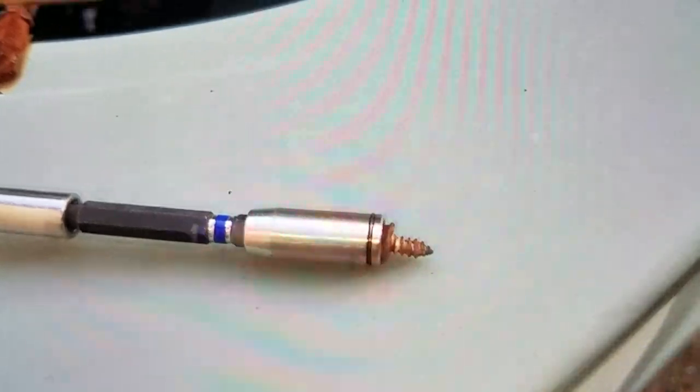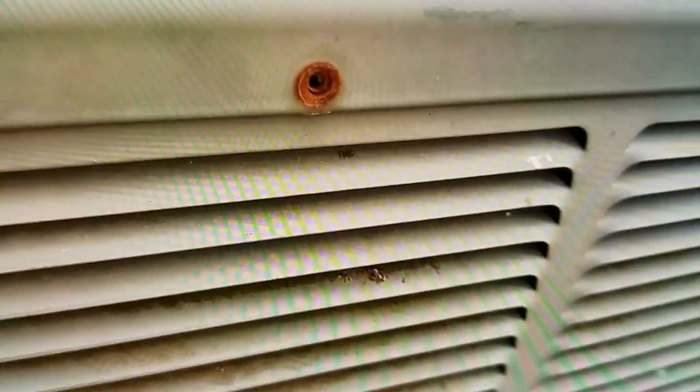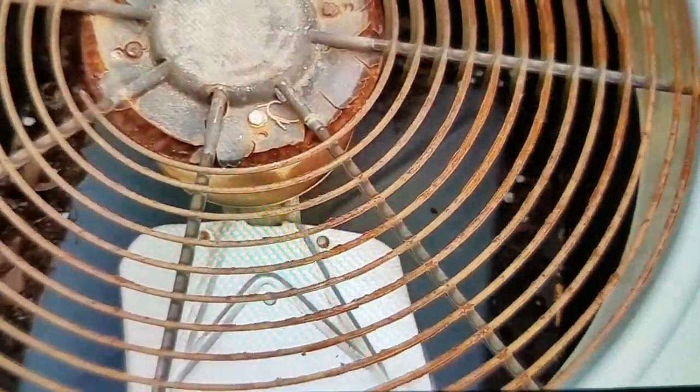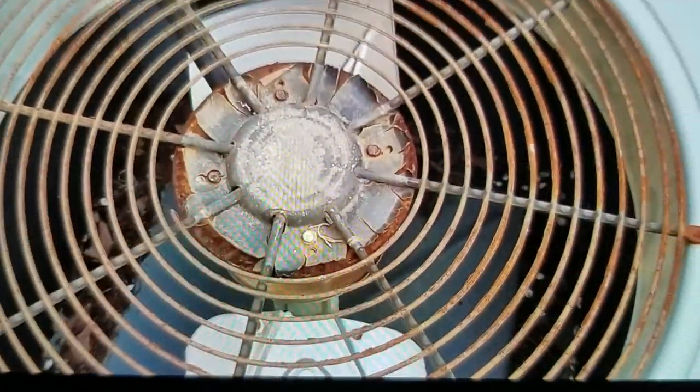All the screws going through the top are extremely short. Looks like a 1/4 inch. There's threads on it there. Probably because there's part of the condenser coil, maybe refrigerant lines running through the top here. So I definitely want to go back with some short screws like these, or at least check the inside after I get the top off here and see how long of a screw I can use.